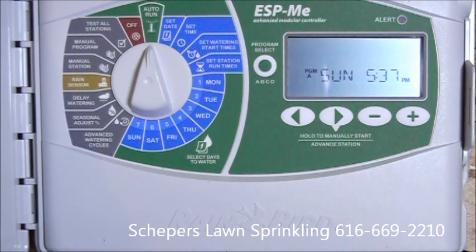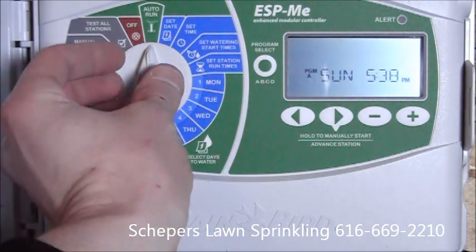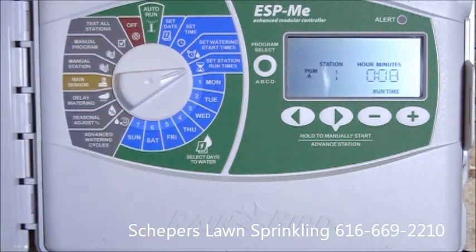This is a video instruction of a unique feature of the Rainbird ESP ME modular controller. In order to turn off the master valve on a specific zone — the master valve is used for turning on a pump start relay, for fertilizer injection, or for iron removal — in some situations we don't want that master valve to run, we don't want the fertilizer to be injected, or we don't want the pump start to run.